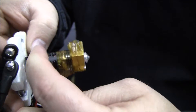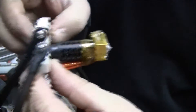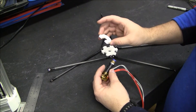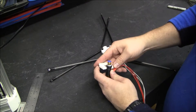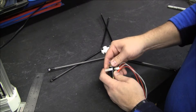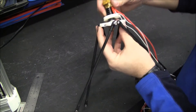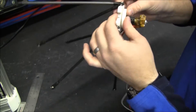You're going to put another plate and bolt it around this lip to hold it in. To mount the hotend into the effector, we have a little bracket here — it's going to go like this. It snaps into this slot and then it's going to squish the hotend in there, and we'll put some screws in here to keep it really tight.